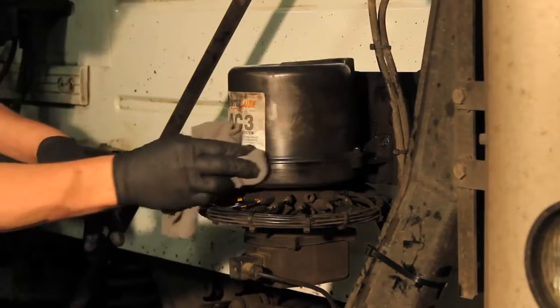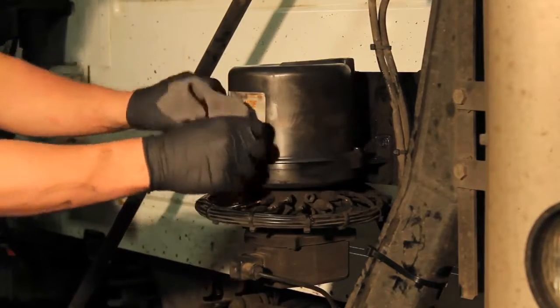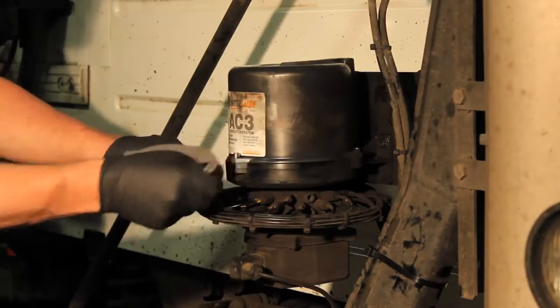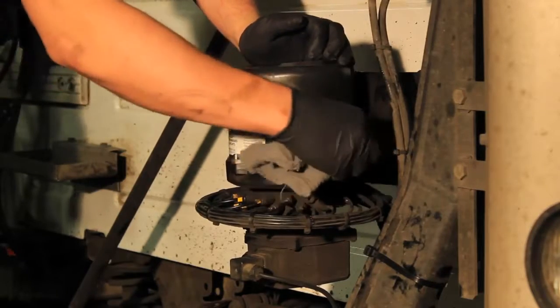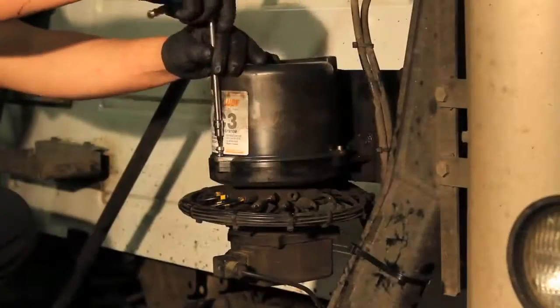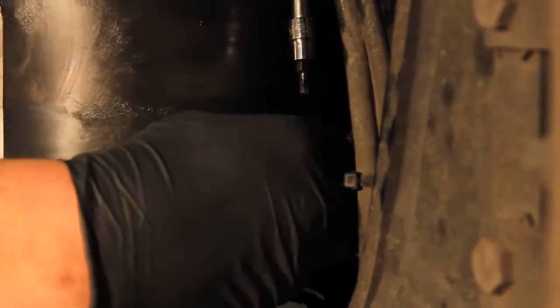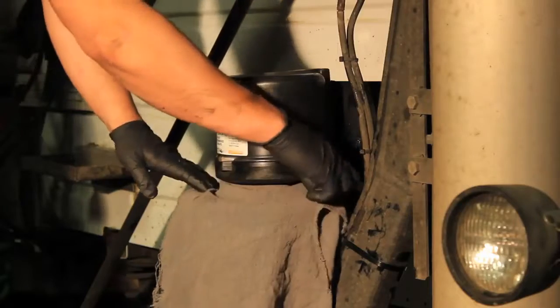To remove the reservoir and clean the vent tube, first clean any dirt and grease away from the area where the reservoir connects to the base of the pump. This will minimize the possibility of contaminants getting into the grease and contaminating the pumping elements. Next, remove the 3 screws from the reservoir, and cover the manifold with shop rags.